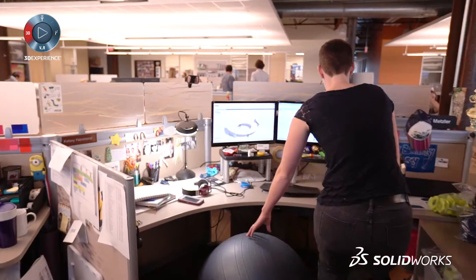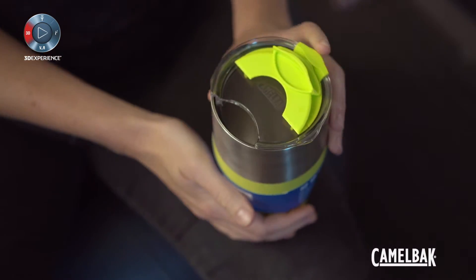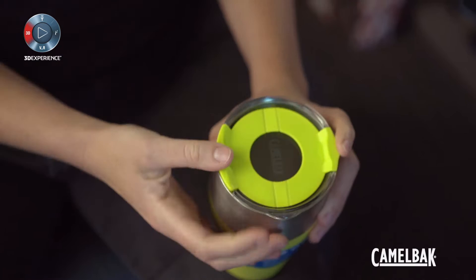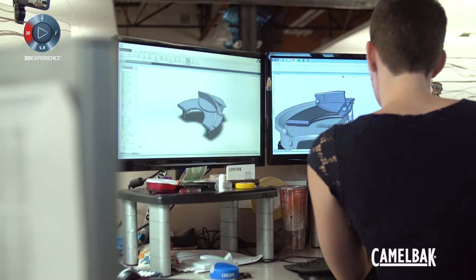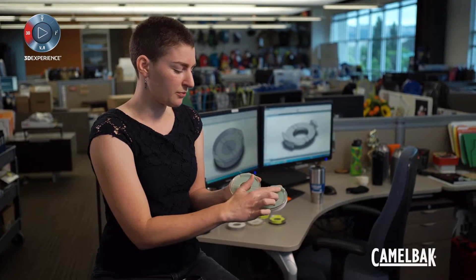The product that I've been working on here at CamelBak is our Kickback product. It's an insulated beverage container with a lid that you drink through, and my main focus has been on the cap. The way the product works is that you have a living hinge — the part snaps open and locks into place. That wasn't super easy to prototype. However, I was able to do motion studies using SolidWorks and refine the design of where that snaps in.